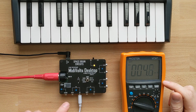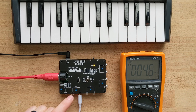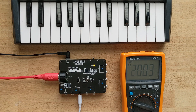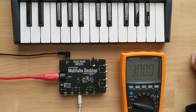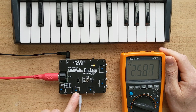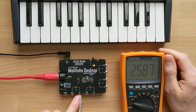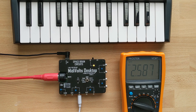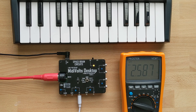I just have my multimeter connected to the CV output. When we press a note, you can see we're getting pitch changes. And as you can see, when I press a note the gate LED lights up, because the CV is acting as pitch CV — you're getting a gate of 5 volts also outputted to trigger envelopes or whatever else you'd want to trigger.